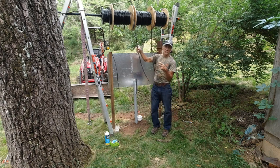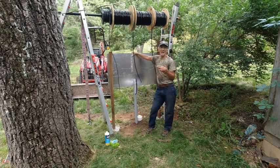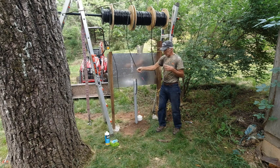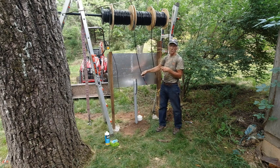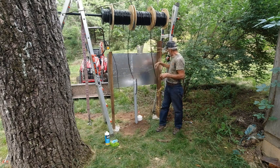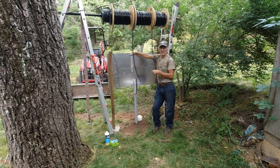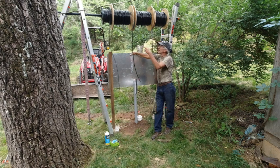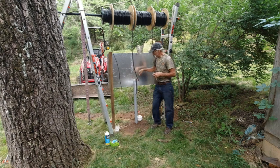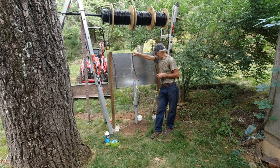I have three number twos that'll be the load-carrying conductors and then a number six ground to pull — I guess just under 220 feet. First thing I did was get set up. It's kind of a jury-rig setup but I think it'll actually work pretty well. I identified my leads: my red, I left the black black, then a white, and then the ground is obvious because it's a smaller diameter wire, so I hook up everything right when I get to the other end. I've identified my spools too. Now I'm ready to go ahead and hook up the 5/16th rope and get ready to pull.